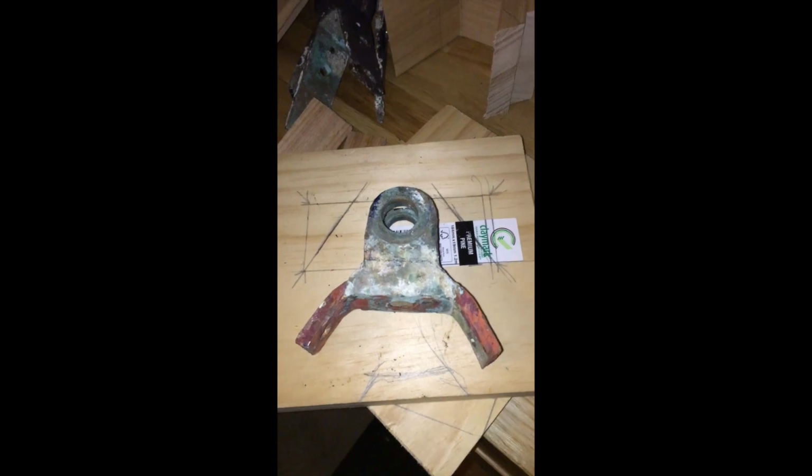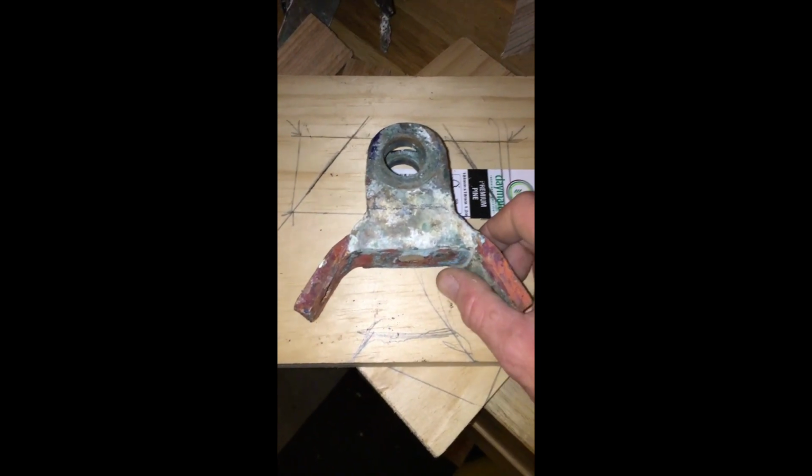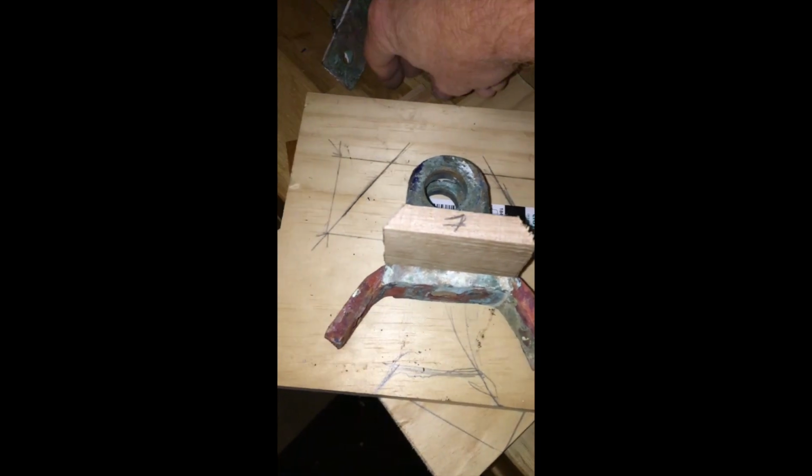Okay, so perhaps a bit elaborate, but here is the top rudder gudgeon. And to fill the space, I'm using this part here, which will be filled with thickened epoxy. It also has a bolt and some other obstructions in the way. These pieces fit in here to replace this and this. And so then to attach the new gudgeon, it will look like this.